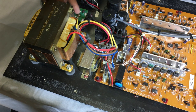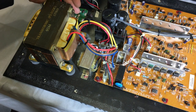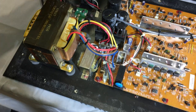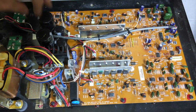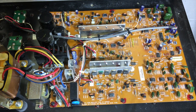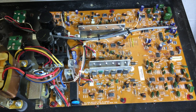These are where the speaker terminals are. Underneath here we have a capacitor and an inductor, and I'm wondering if the crossover on these is passive - that's what's cutting off the bass for the cubes, just what's underneath here. If so, I mean that's a real simple way of doing it. And the size of these caps - these are monster size. These are 10,000 microfarad, 50 volt Nichicon caps. They ain't messing around.